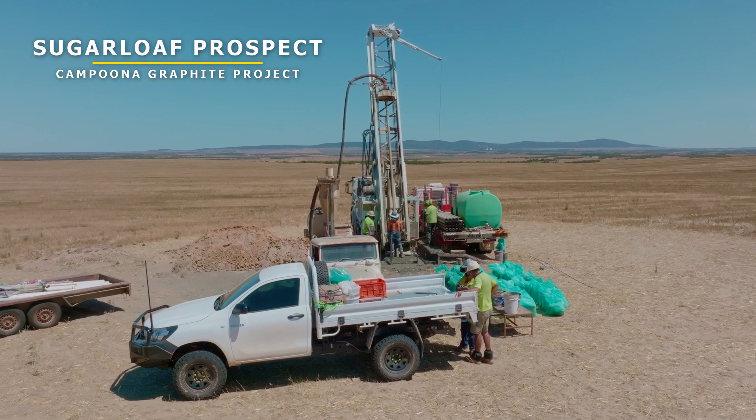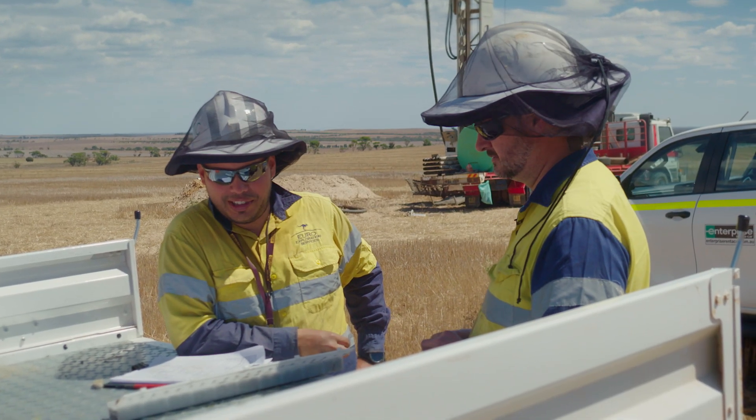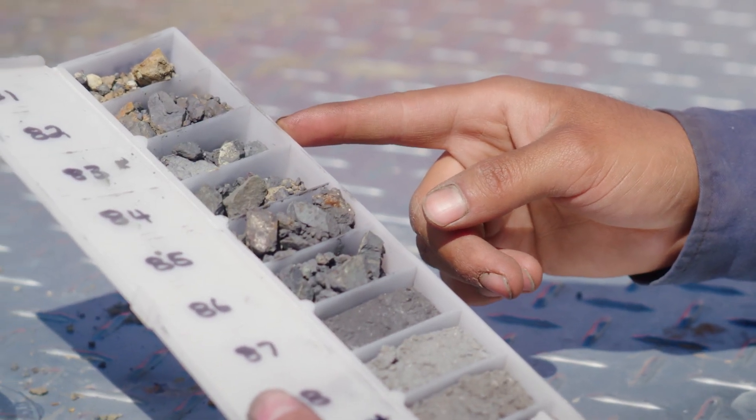How I see it with ITech Minerals and metallurgy, we have a number of stages. ITech's role is to go and get out of the ground, find an ore body, and then it's your role to try to take it from ore grade — which is anywhere from seven to ten percent — and then make a concentrate out of that, upgrading it to up to ninety-four or ninety-five percent, and getting recoveries of above eighty percent.